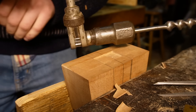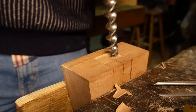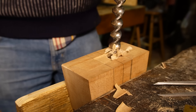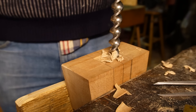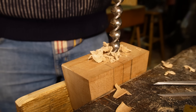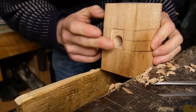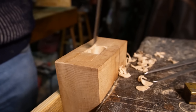That way when I do bring the brace and bit to it, it won't tear out more than it needs to. So we'll just spend a few minutes here tipping away with the mallet. I have my bit here and my brace and I'm just going to screw it all together and use it to bore a hole the whole way along the mortise. That'll allow us to remove all the excess wood a lot easier with the chisel afterwards instead of doing the entire thing with just the chisel. We nearly missed but we got that fairly close now. Then we can just come along with the chisel here and finish off what we started.